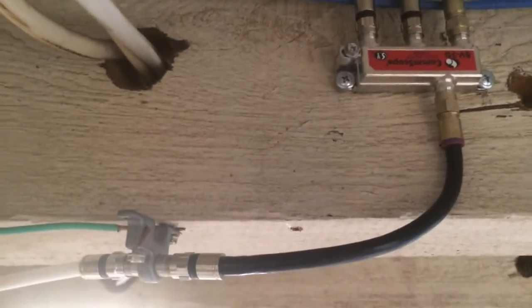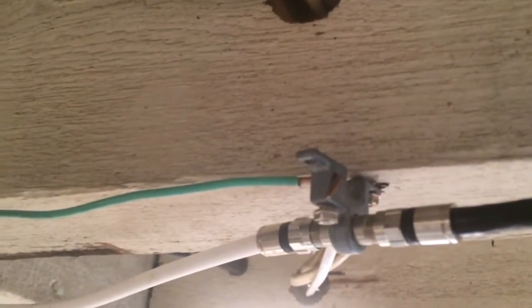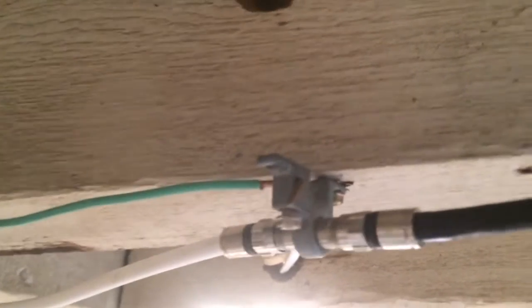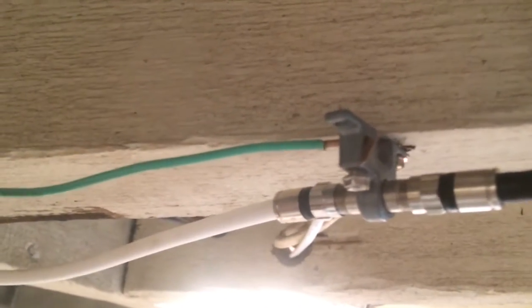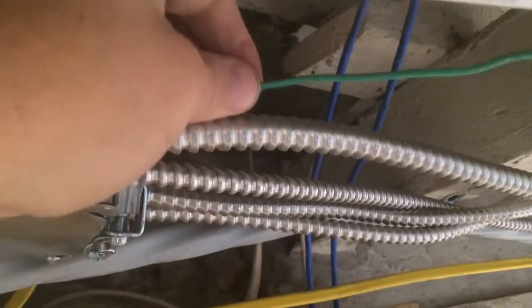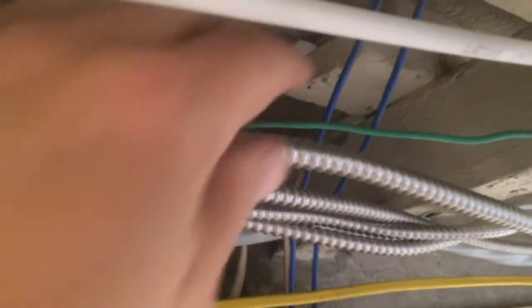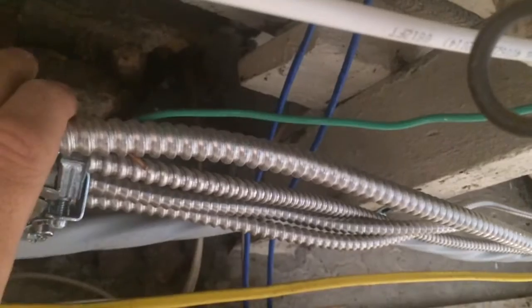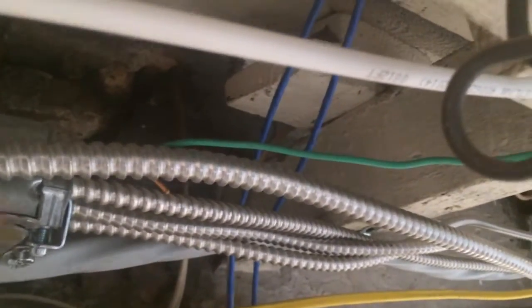This is a cable hookup. Do you ever wonder why sometimes you have really bad cable signal? I came down to this place and we were trying to figure out why it was going on. This is the ground wire that goes to it — the ground actually helps to keep the cable signal clean. It was just wrapped around a piece of metal wire, and every time that wiggled, the cable system came out with snow showing on the picture.